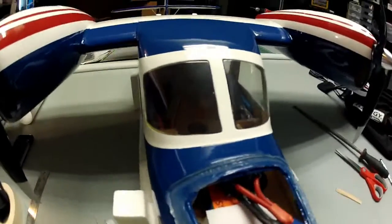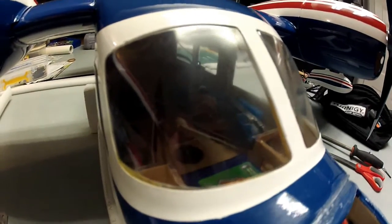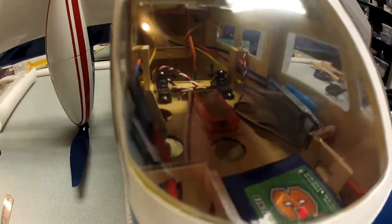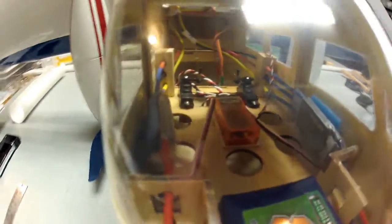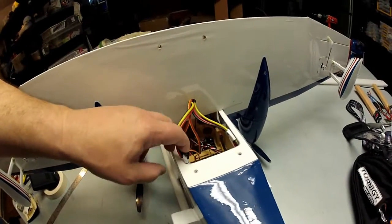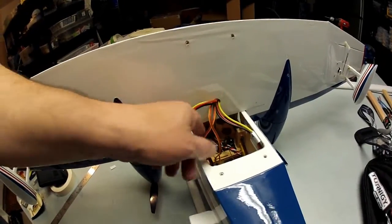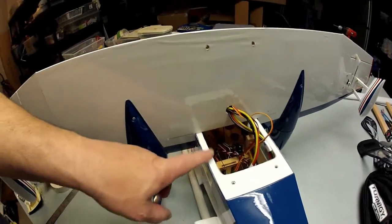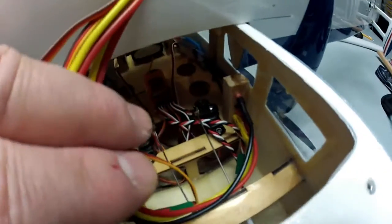The battery is in there. I'll take the wing off to get more light in there. The wing is off but still attached electrically, and I mounted the receiver in there. There's an ESC on either side — this is the way they recommend. Because the ESCs are inside you have to plug in the cables: three for each motor plus two servo cables for the servos in the wings, so there are actually eight cables to plug in. The cables for the ESCs are very short, so I mounted these plugs on a kind of manifold to hold them together. That way it's easier for somebody with big hands to reach in and unplug and re-plug — much easier than trying to get in there with two hands.